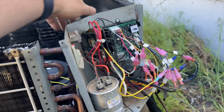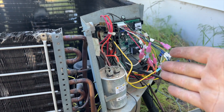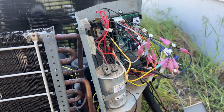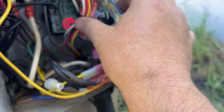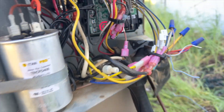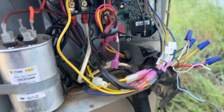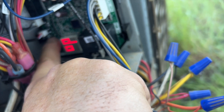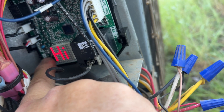I've depowered it and turned off the indoor unit so there's no 24 volts. We're going to turn on the 24 volts, configure the board, put everything back together, and cycle it. The indoor powered up and the high voltage is still off. We've got to program this board — there are two buttons: Option and Select. We need to tell it if it's O or B for the reversing valve. Pushing the Option button, it shows the orientation setting, and I hit Select.